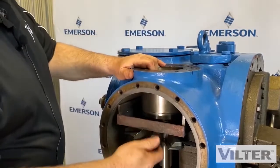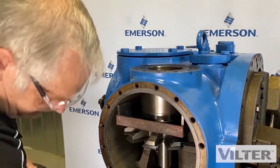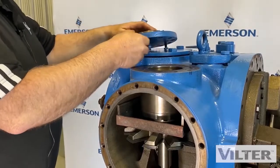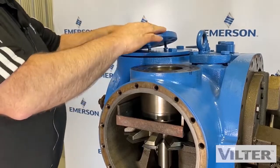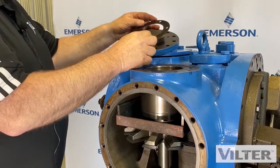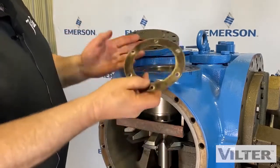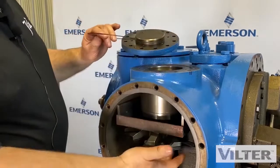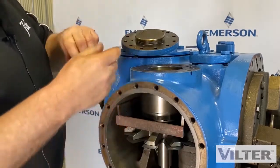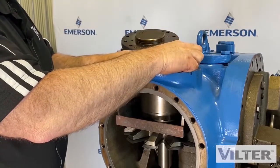At this point I'm not turning this yet because we're going to put the cover back on. We've got this cover and remember we have the shims in the back. What do the shims do? They lift this against the back plate to give us our shelf clearance — and these were calculated based on this machine. So we can stick those in place.